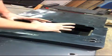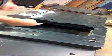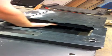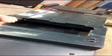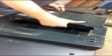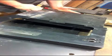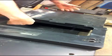So let's say you've got locking access here, you could just reach in there and pin that, or you could have just a pin that goes through the wall here and into the lid frame as well, a separate pin. It wouldn't necessarily be a lock, but it would make it impossible to open it. Even if you could pull this out and you had a pin intersecting the body, the lid would be locked into place. If you had the bar all the way shoved through and you had that pinned, it wouldn't be able to come out at all.